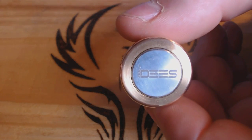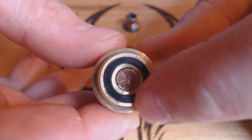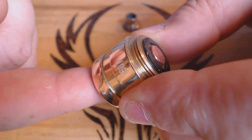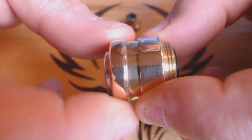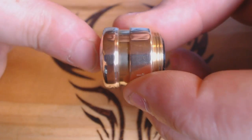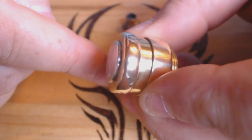We'll start with the switch. You can see the logo there. You've got your copper contact and your Delrin insulator that the battery sits on. Push — oh, it's locked. It has a reverse-threaded locking button. Push the button and this pops up. It also has a serial number on it — this one is 199. To show you how it works: there's your button, turn this and that's it locked. You don't have to screw it all the way in to get it to fire — you just need it to clear the Delrin, and that's far enough for it to fire.